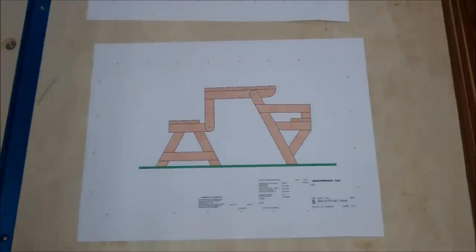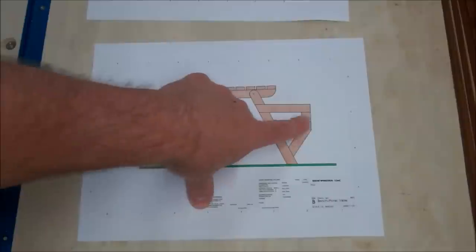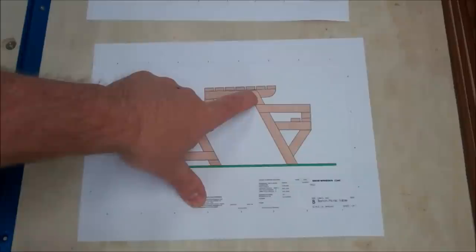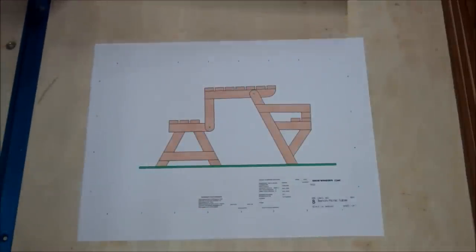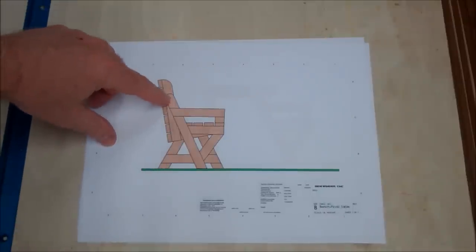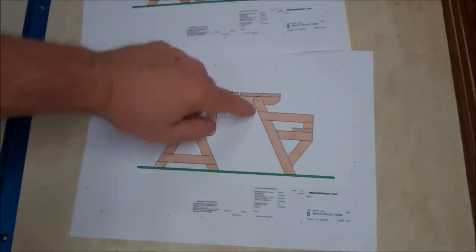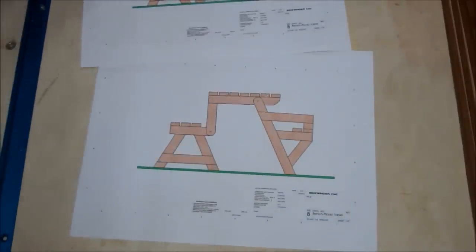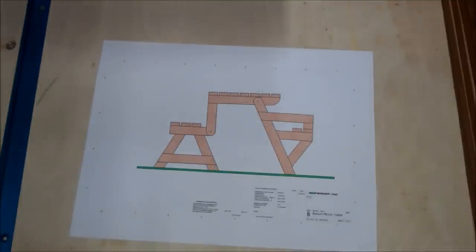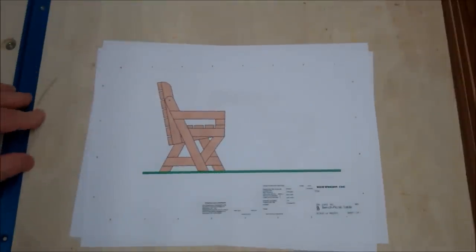And really as I study it more, it's really not that hard at all. The biggest thing you have to keep in mind is right here where this leg for the second seat is — where that hole is located. You have to keep in mind that when you pivot this thing around to put it in the bench position, the height from the ground to that hole needs to be the same as when it's extended, to get the table level. That's really the most critical thing. But anyway, I'm going to go ahead and get started cutting some parts for this.